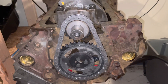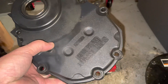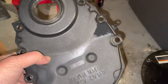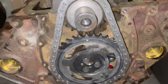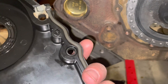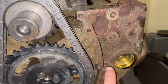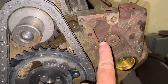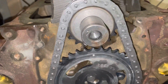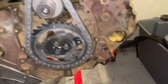In the last video segment I was about to put the front timing cover on. The cover I was going to use is this plastic one — it's for Vortec V8s from 1996 up to the end of the small block — and I thought it would fit the older block. As it turns out this cover will not fit on this block. These rubber seals run out past the flange — the flange is not wide enough — so it leaves a little hole at the back side of the cover at each bolt location, allowing oil and air to escape or leak.